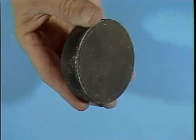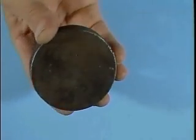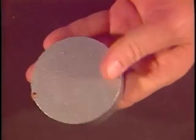The jack pad should be made of 2-inch to 3-inch diameter steel bar stock cut to a thickness of a 1/2 inch. Round the edges, sandblast, and prime with Philly-clad 1000 if required.